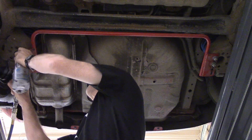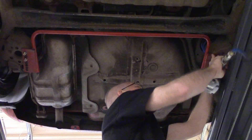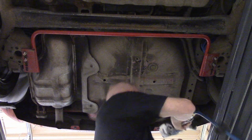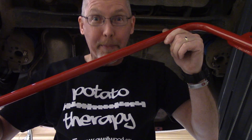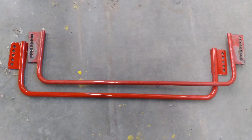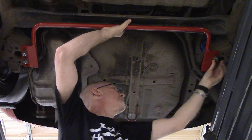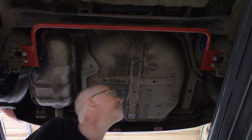So we'll get the old bar off. I didn't position this well on the hoist, so I need to use a universal — and I don't have any impact universals at work. So I just held on to the little chromey and wished it wouldn't fly across the room and hit me in the face. At any rate, it pops out pretty good — just a little bit of wiggle. And before we put the new one on, let's take a look at the two side by side all painted. Now you can totally see the difference in size. The first one was 3/4", aftermarket bars are 5/8", and this one is 7/8" — so I'm up a significant amount thicker. Let's put it on. Well, that was easy. Now to see if it works.